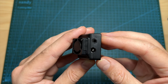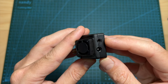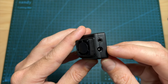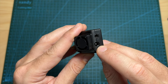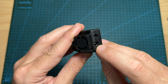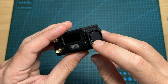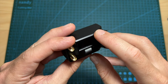As for the ground station module, on its right side you can find a 3.5 mm auxiliary port, which only supports video, so pay attention that audio is not supported. Powering it up is done using this DC plug. The supported DC input voltage is between 6.5 to 26 volts, so you can power it directly with between 2 to 6S batteries.